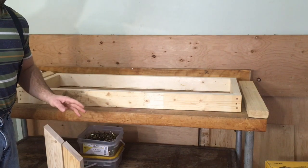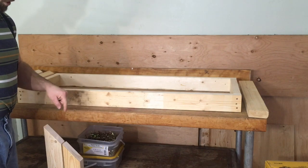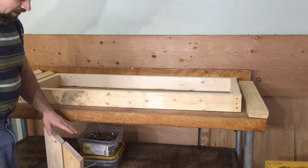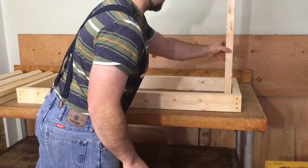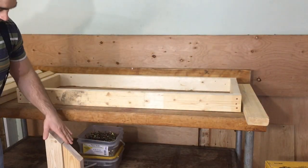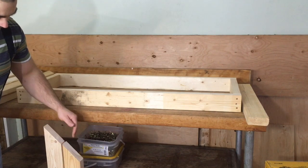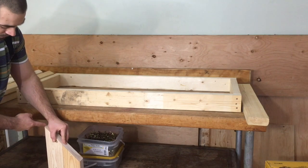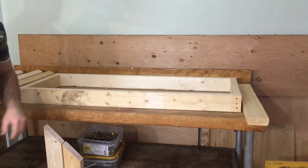I'm likely shorter than you so you'll probably have to have everything a little bit taller than the dimensions I've put in the description. When you adjust the heights you have to adjust both the uprights on this side and the upright on this side because the height matters over on this side as well. Just remember these are two by fours and so they're three and a half inches across. To get the heights to line up, just make sure that the taller piece is three and a half inches taller at the point than the measurement to the point on the shorter piece.